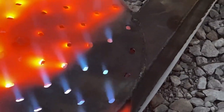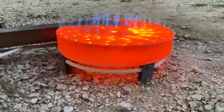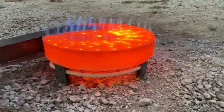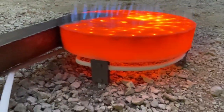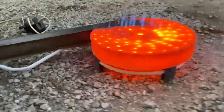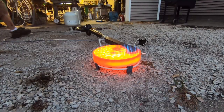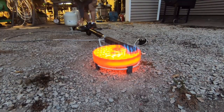It's going inside a firebox — the whole burner — so there will be more than enough heat flying around to vaporize the propane just fine. Same thing with the air duct; it will also be within the hot gases of this burner. Look at the vapor cloud on that vaporization coil — you can see it fluttering around like frost in cold air. Pretty amazing — we've got fire and ice here.